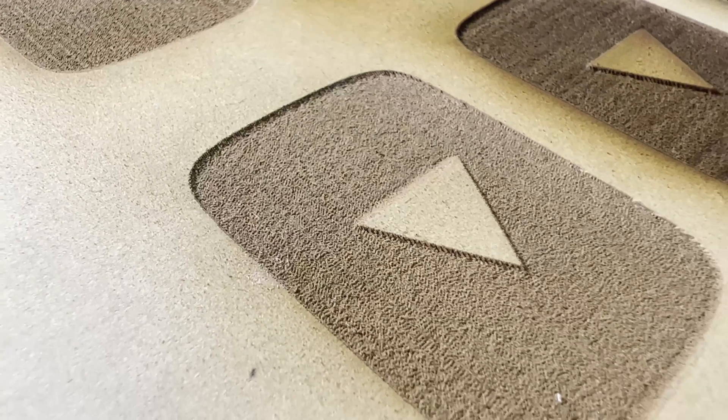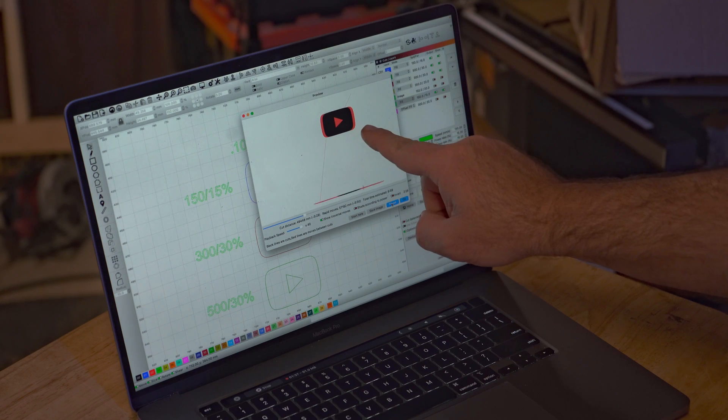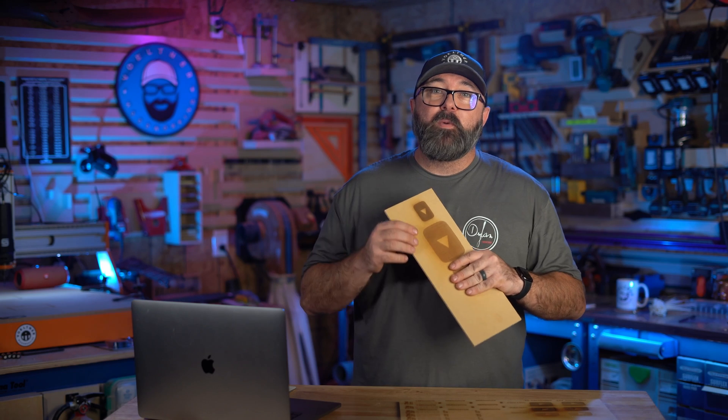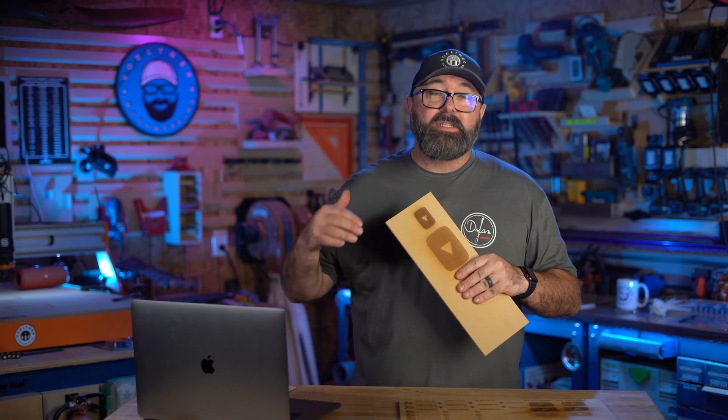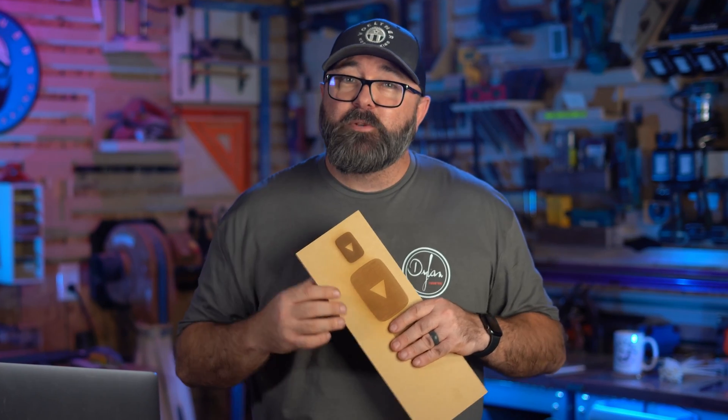The issue is the distance that your laser needs to travel along with the acceleration and deceleration needed to do the engraving. In these examples, the engraving is less than 2 inches in length. Although we increased the speed with each subsequent test, because it had a very small distance to engrave, we really never tapped into the full potential of the speed we set. What would happen if we increased the size and ran it at 500mm per second? It turns out that running exactly twice the size of engraving resulted in more than double the time, so the increased time was exponential. This tells me there's a sweet spot for my machine between 250 and 300mm per second for the typical size of engravings that I do.